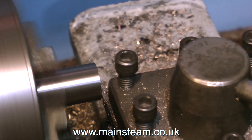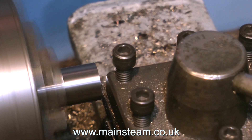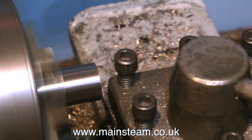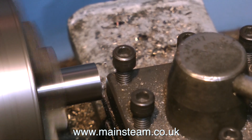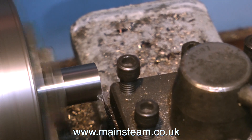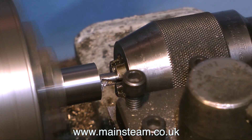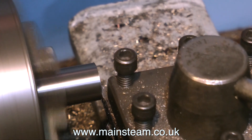What I used to do frequently with steam locomotives is center drill the axle, then drill a small hole down the center of the axle, and drill a hole at 90 degrees to this exactly where the axle box was. This is a good way of lubricating the axle box — the normal way is to pour oil into a little reservoir on top of the box, but that reservoir would contain grit from the firebox. By putting the oil in down the center of the axle, it was always clean oil that flushed out the axle box.